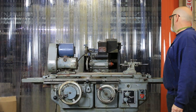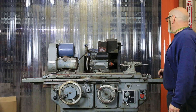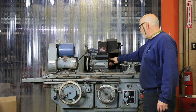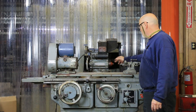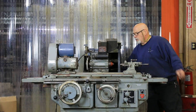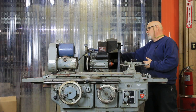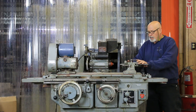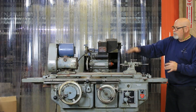In order to set it up for internal grinding, there are a few steps. There's a different belt that has to be used, and in conjunction with the flat belt for the spindle, there's another V-belt that has to be used here. There's a knob on the back which needs to be loosened and then the motor shifted over — there are some hash marks to show you exactly where that needs to go.